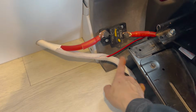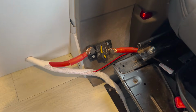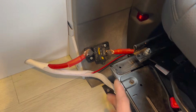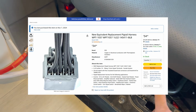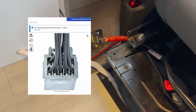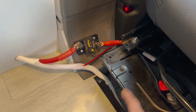This wire loom, there's two wires in here. One of them goes to our heater, which is unrelated to this, but this other one is a signal wire for the C-Tech unit. And basically, because the Ford Transit that we have has a smart alternator, you need to hook this up to a terminal underneath the battery bank here, and I'll show a picture of the wiring harness that I had to buy in order to do this, and I'll put a link to it in the description too. You have to hook that up and then hook in this wire to one of the points, and this sends a signal to the C-Tech charger, so when the ignition is on, it will start charging.